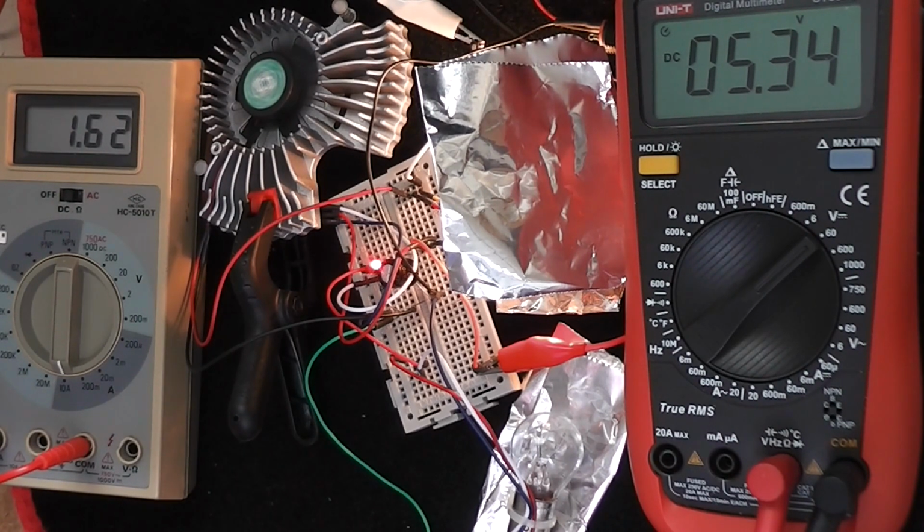I don't have many power resistors, so I've used car tail bulbs instead. Whilst perfectly acceptable, these bulb filaments have a non-linear behaviour. Their resistance is low when cold and higher when hot. That's a positive temperature coefficient, isn't it? In fact, it's an S-shaped VI curve. It's also worth adding that my breadboard setup is barely adequate for the currents involved.